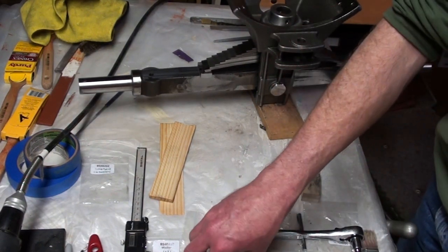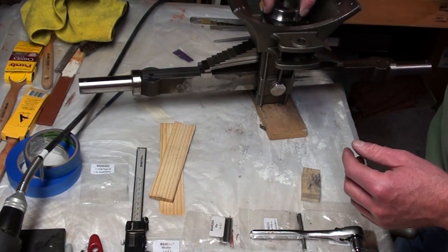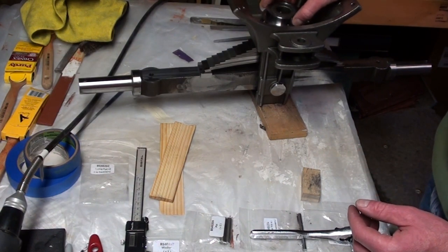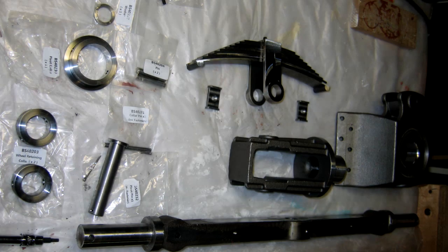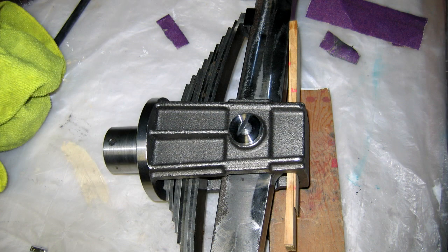Because the axle will need to be removed during further assembly, I opted to install one split pin to the securing pin. When temporarily assembled, a wire bread tie is passed through the other end of the securing pin to keep it from sliding out. This will be replaced with the remaining split pin upon final assembly.